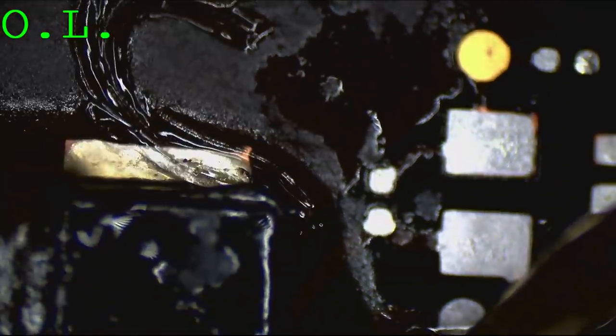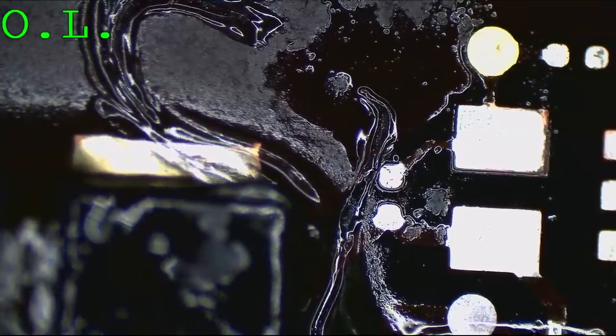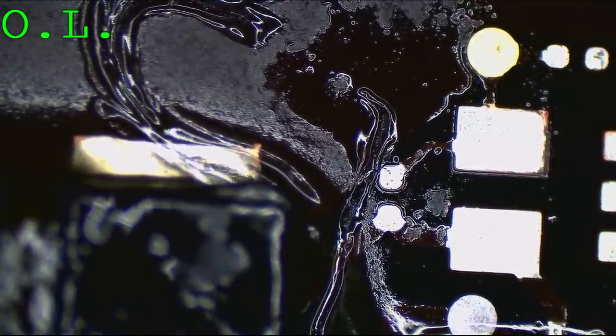Let's see, this cap to ground... Yeah, this is 0.4 to ground. Measuring one of these caps. Okay, so jumpers across and let's go. Your output is shorted to ground. Yeah, the caps that are filtering the output. Maybe the caps, something in the circuit still shorted to ground. That's interesting. He took the system resistor out, so this is just the supply side, and one of the caps is clearly shorted.